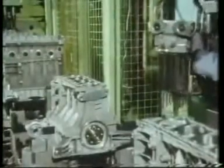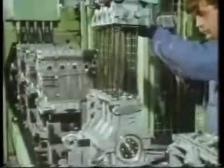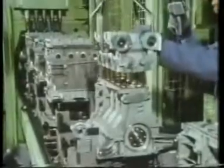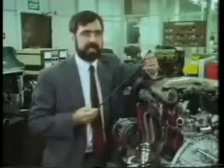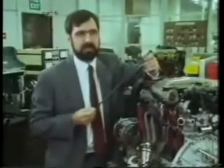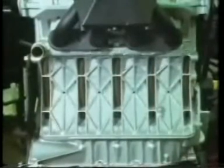The development of the new engine took six years. As the design evolved, it became clear that the long bolts could not be included without rethinking the shape of the whole engine. We ran the bolts down the outside of the cylinder block on the basis that they would function equally well there — they didn't need to be internal to the engine, and we would save weight on the cylinder block itself. Unfortunately, there were disadvantages with that route. The entry and exit points of the bolt, where they went back into the crankcase and exited from the head, were very difficult to keep oil tight. And as such, we abandoned that idea.